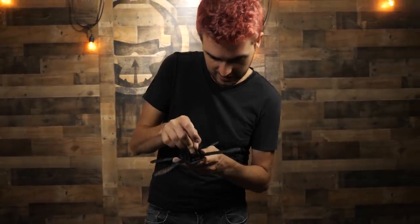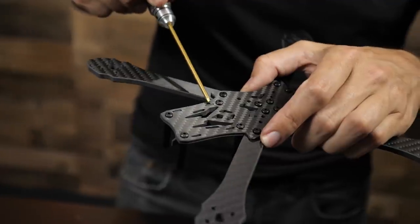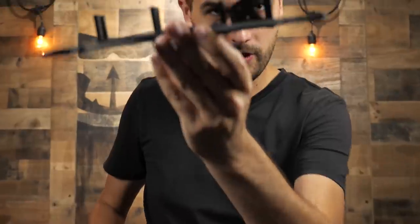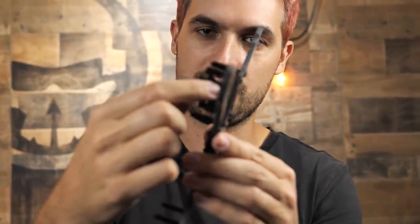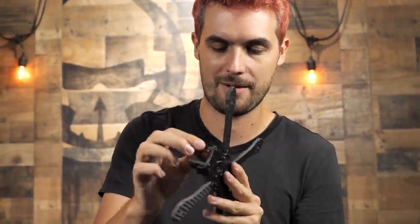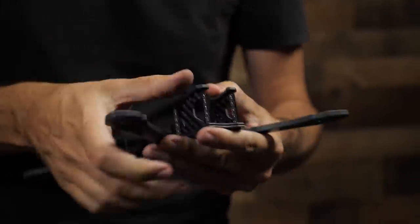Before putting the top plates on, get the camera plates in place. Insert them into the tabs on the bottom plates - the tab goes all the way through the stiffener piece and the lower bottom plate, so you should see it come flush with the bottom. Orient them so the front cutout faces forward - this gives you clearance for 3D printed pieces for mounting micro cameras that slide over the standoff. That way you can use the camera plates for additional stiffness while also having camera mounts that go over the standoff.